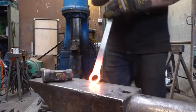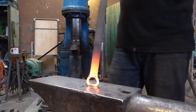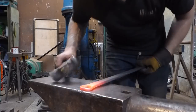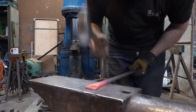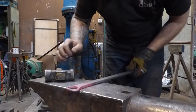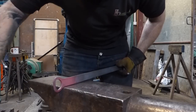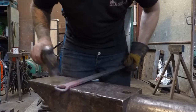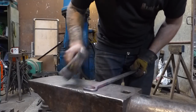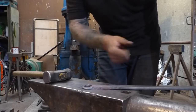Now to make it look like a bottom. Very easy at this point to get carried away. I'm just holding it onto the anvil and tapping the back of the bar. I'm going to give it five or six taps, a bit of a brush, and have a look — it looks okay to me. One of the things I like to do is flatten it down when it's at this point. I've got a bit of a chamfer going and I can see I need to hold my hammer in a T shape and just give this corner a tap. Basically, that's your bottle opener. Now I'm going to take a round nose punch, give it a bit of a crack there and that's going to give me the material I need in order to make the clip.